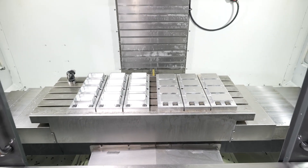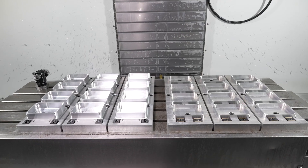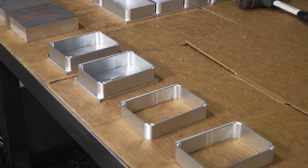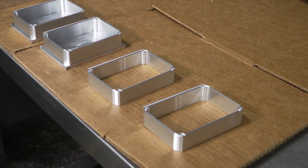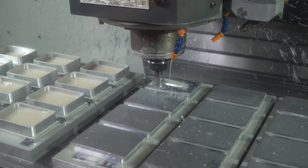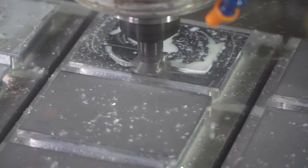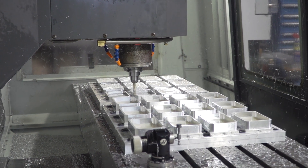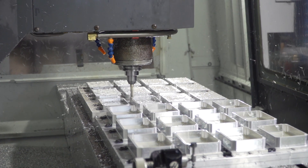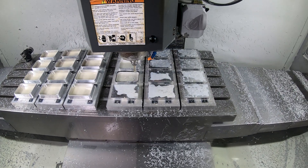One of the common parts we're machining today is a simple case. There are quite a few parts involved — we're making about 1,500 a year currently. It starts with a solid block of 7075 aircraft quality aluminum. The first two operations we machine 12 of the first ops and 12 of the second ops. The fixture designs allow us to machine almost lights-out throughout the night. It not only reduced the cycle time because of the quantity, it reduced wear and tear on the machine — there are 11 fewer tool changes per cycle per part because we're doing so many on the table at once.